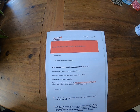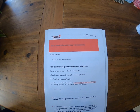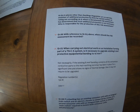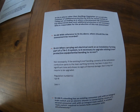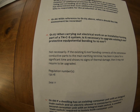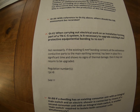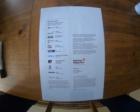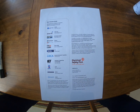Now you might say to me — but that didn't state PME systems specifically; it could be TT or TNS. Fair enough. However, here's another document published by Electrical Safety First: Frequently Asked Questions in the Electrical Industry. Question 67: when carrying out electrical work on an installation forming part of a TN-C-S system, is it necessary to upgrade existing 6mm squared protective equipotential bonding to 10mm squared? Not necessarily. If the 6mm bonding connects all the extraneous conductive parts to the main earthing terminal, has been in place for a significant time, and shows no signs of thermal damage, then it may not require upgrading. Once again, one point to the 6mm — so we're now at 2-2. Now it's fair to say that the 10mm points have more value because they come from the NIC EIC technical helpline, and not just a best practice guide. However, NIC EIC is listed among the organisations that Electrical Safety First is indebted to for their contribution and support to the development of this guide.